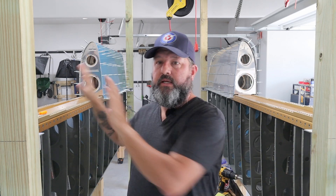For those unfamiliar with Van's wing construction, it might look like I'm not done with the leading edges — that's because Van's uses a wet wing fuel system. The inboard leading edges are actually the fuel tanks, so the next couple of weeks will probably be consumed with making sure I have these fuel tanks completely sealed up, airtight, fuel-tight, and ready to be mounted to the wings.